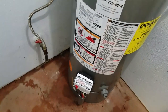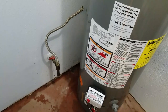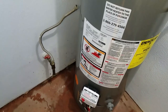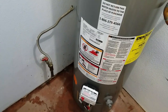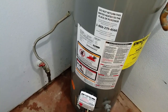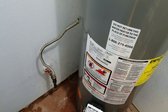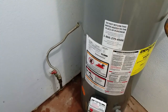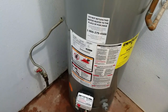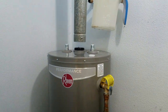I usually replace the flexible gas hookups because I've had them leak after you move them around a little bit. This one is circa 1984, but I'm going to hook this one back up — I've never had an issue with it, it's never leaked. I'm going to suds it down when it's all installed and just make sure it doesn't leak. The new fittings from Home Depot are made in China and they're absolute garbage. I played this game with one of my gas dryers and the old hose was actually built better than the cheap stuff they're making now. So the next step is the chimney.